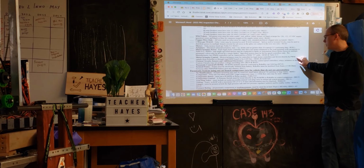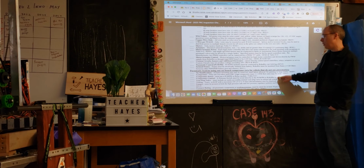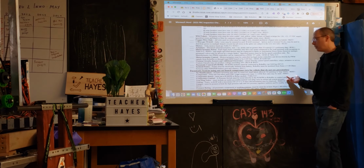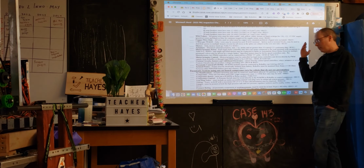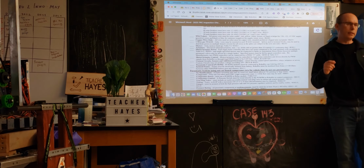Motor controllers. We weren't using PWM. We didn't really do anything heavily custom. Pneumatic controller, they spent some time. You can see there's a whole set of pneumatic items there, both from the controller, and then you had a whole set of pneumatic things to test that we went through at that point. Connect to the CAN. This one he actually tested. They were looking for isolation on the frame. They want to make sure that the frame isn't connected to the electrical so that you can't hurt anybody. But it's also good practice because a lot of times you can get interference related to that if there are other things going on.